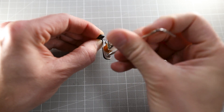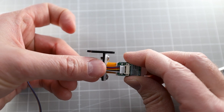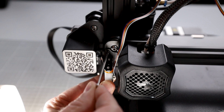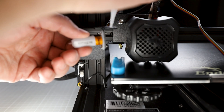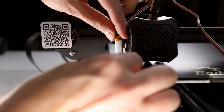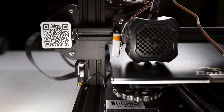I'm using the shorter ones, the M3 x 6mm. On the backside of the BLTouch, I connect the small connector of the cable, carefully pushing it in until it locks in place. Then I bring the holder into position. On the Ender 3 V2 there are normally two screw holes that perfectly align with the bracket drill holes, and you can use the other two screws to fix the bracket. However, in my case — and maybe for a few of you — Creality forgot to drill these two holes, probably because it's a very early version of the Ender 3 V2. So instead of screws, I'm gluing the holder to the carriage. To find the right distance of the probe to the print bed, I'm using a little helper tool that gets inserted between the bed and the sensor, while the nozzle should be just touching the build plate at the same time.